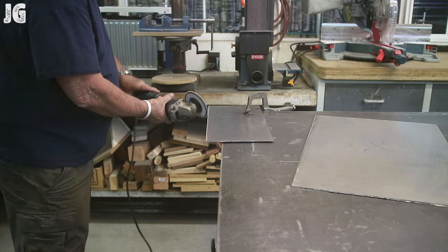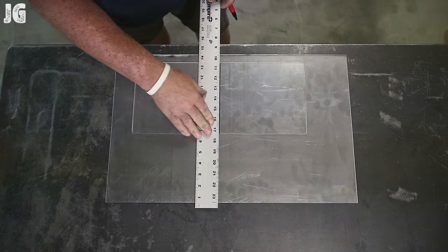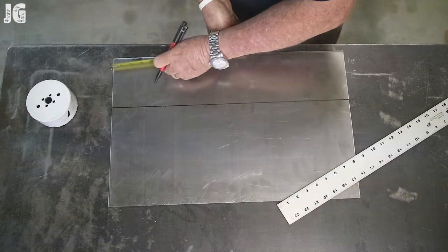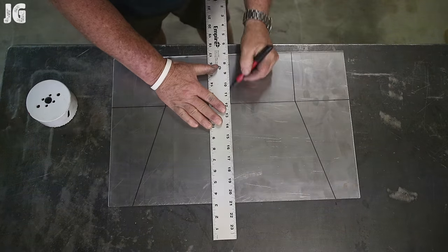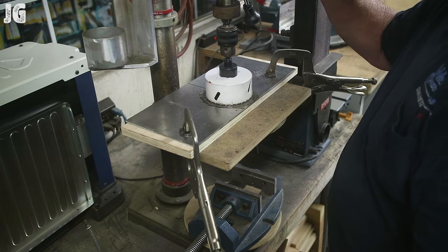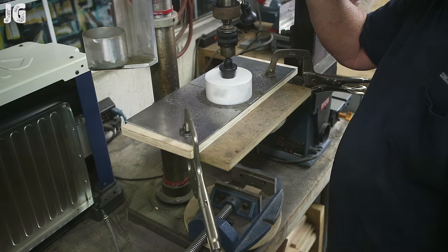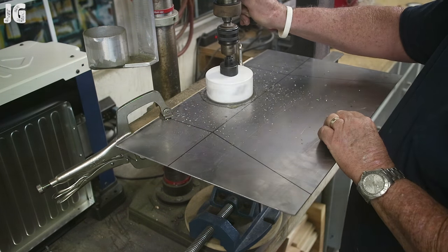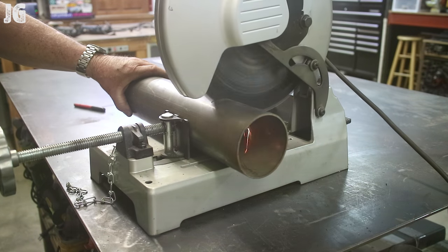Once we did that, I did the layout — laying out for the four-inch round hole we need to cut, and the layout for the giant dust pan. Once I got everything all laid out, I took everything over to the drill press where I mounted the hole saw and proceeded to start cutting things out. It gets a little bit difficult with a big bit like this — it takes time and a lot of lubrication. The drill press wanted to keep stopping on me, but I was able to work my way through it.